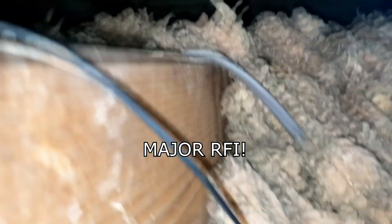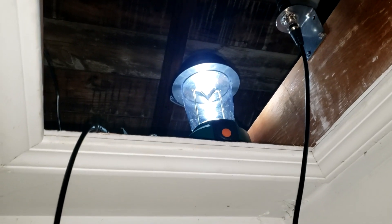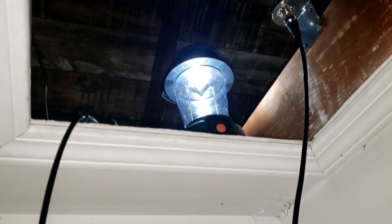Man, that was a pain. The coax runs down through the hole I drilled. Let's finish up running the coax and then we can have some fun. I made a couple of little adjustments — I put a cable clamp right here and I put a little S-bend in the coax to take some of the strain off, because all the weight of the coax was just on the connectors and I didn't like that. I also put a piece of tape here so stuff doesn't go falling through the bottom. Just got to put the cover back on and run the cables to the radio.